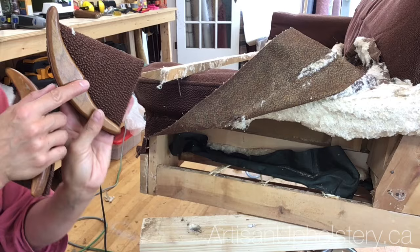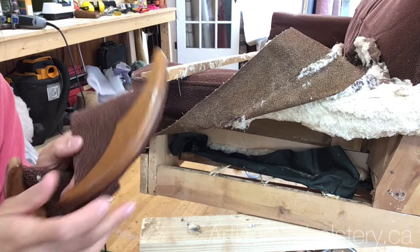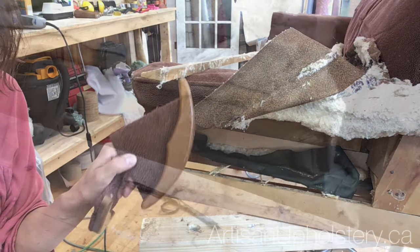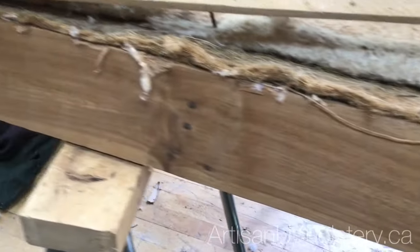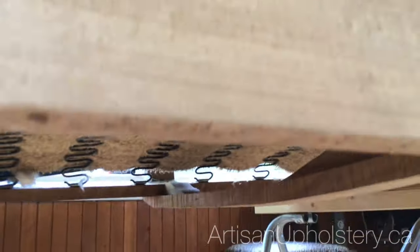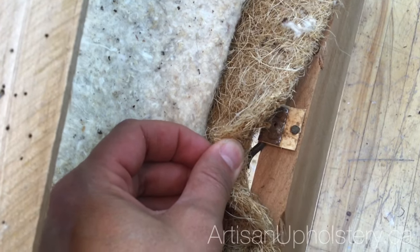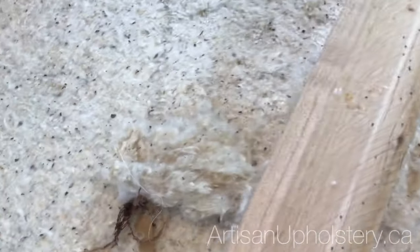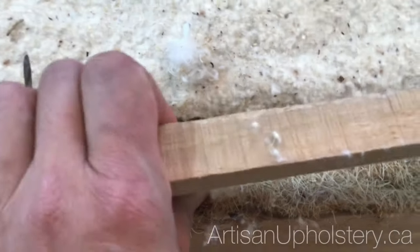On the front you've got facings with real wood, and this is the kind of nice wood that you can only really find on vintage pieces — I have yet to see a new piece with wood like that. The front rail is very important that it be hardwood, because those springs are attached to it and you don't want it to bend. Anything softer or smaller than this will eventually bend and crack under the pressure. The deck is padded with cotton, and this seat edge rail is hardwood — nice and thick.